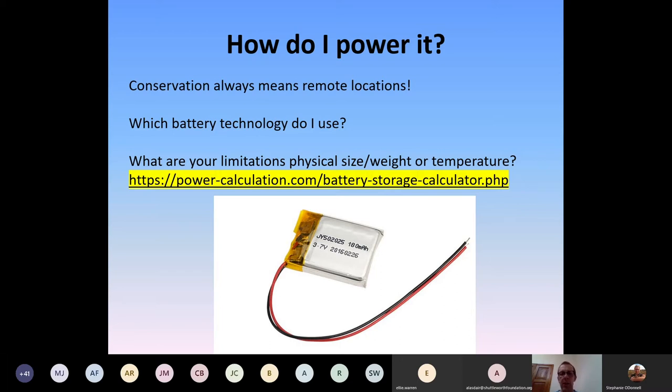There are power calculators — I'll put a link in — where you can input your voltage and current information to determine how long your system will run and what battery to go for. Physical weight and dimensions matter greatly; we've had field workers carry heavy batteries an hour or more to install kit. Lead acid batteries can be a problem on a backpack. We've also had cow collars where nickel metal hydride batteries didn't perform at minus ten degrees — nowhere near the expected capacity.